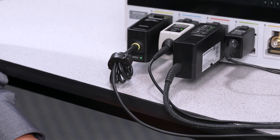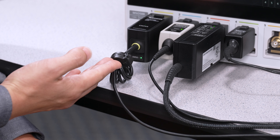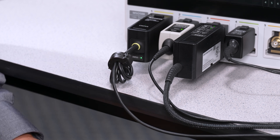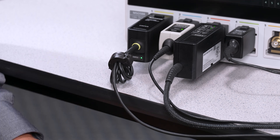One last note on probes. The isolated current probe comes with a clamp-on common-mode choke — a ferrite. This is standard with every TICP, and we find that putting several turns of the probe cable through this common-mode choke greatly reduces ringing and common-mode artifacts in the signal.